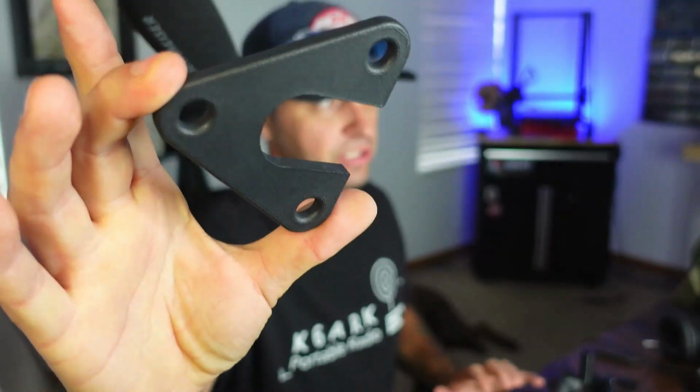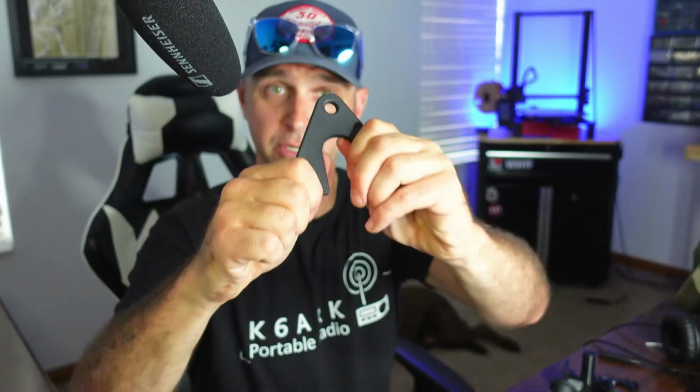Now, let's take the legal matter aside, okay? The fact that if I sold these, I would probably get sued. All the legal troubles aside, if I sold these right here as the production unit you see, I would not sell any of them, because really at the end of the day, PA12, which this is made of, is very durable. It's great, right? It's a nylon type material, very strong. It uses multi-jet fusion in order to adhere all the layers. And so, yeah, great, except for me to make 2 of these would cost me about $27 for 2 of them.